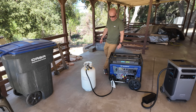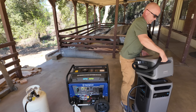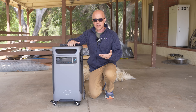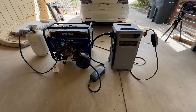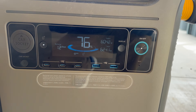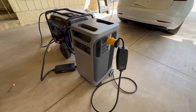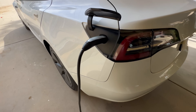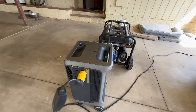If you charge only the Anker F3800 Plus from a generator, it can only pull 3,300 watts. With one add-on battery while charging, it can pull a combined 4,300 watts. With a second add-on battery the company informed me it would pull a combined 6,000 watts. It's also worth noting that if you're charging the Anker with 6,000 watts of AC input while simultaneously putting a 6,000-watt load on it, it will output 6,000 watts in a pass-through capacity — demonstrated here sending power from a gas generator through the Anker F3800 directly to charge an EV.